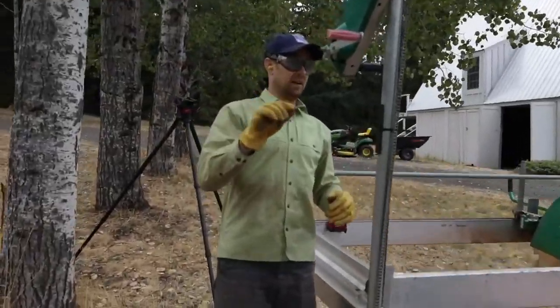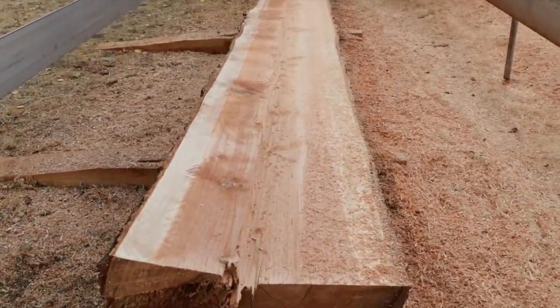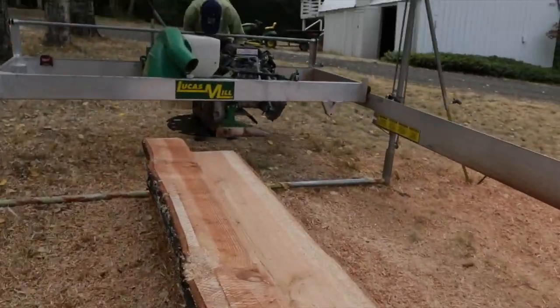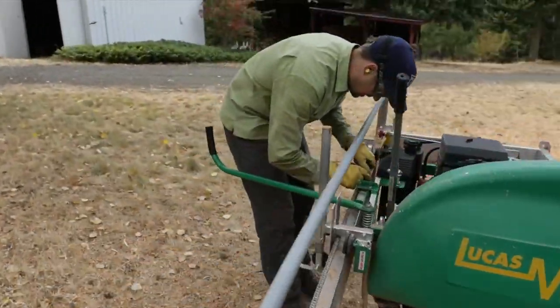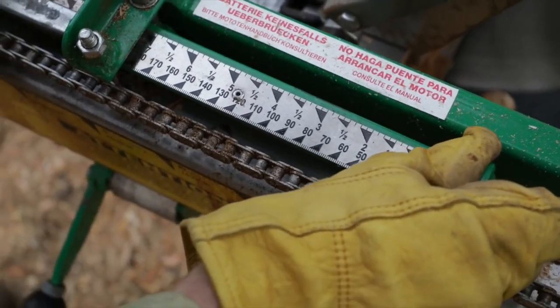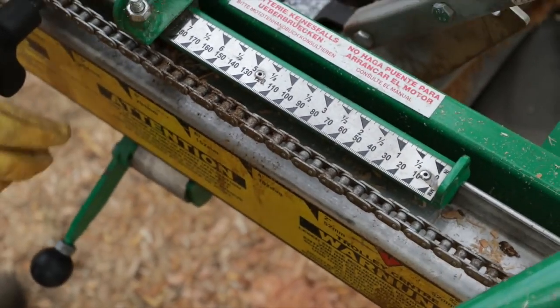Plus a little bit. Okay, coming down 3.5. 3.5, and let the line show, so a little heavy. So this was our biggest log, and we've gotten a lot of lumber out of this one, so we're gonna go for a 4x8 here. Eric's setting it up. 4x8, Eric. 7.25. There's this side we want the 7.25 on. That's right. We give it a little extra. Right there. Strong.